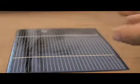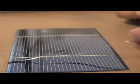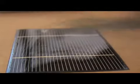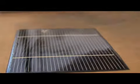You want to have your tab wires to be twice the length of the cell. Now, I went ahead and cut these in advance. You basically just measure it, double it over. It's a good idea to do all of your tabbing wires in advance. That way, you don't have to come back and do this step.